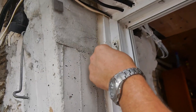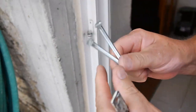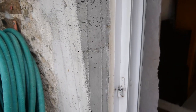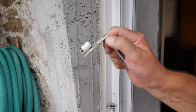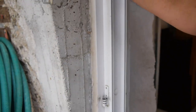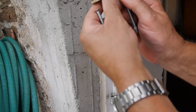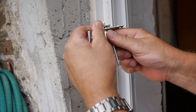So what I've done is I've looked in my garage, which is full of nuts and bolts and all bits and pieces, to find some threaded rod like that. But you notice the chamfered ends there. They will fit quite neatly, not absolutely flush, but enough so you can close the door. If it was like that, you couldn't close the door. But that allows you to stick the spigot end of the hinge inside the hole there. Let's do it on the other one to show you even better. Any more than that, you're not going to get the spigot in that hole.